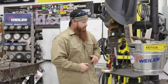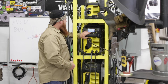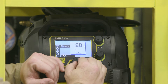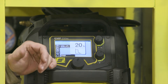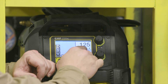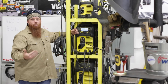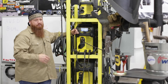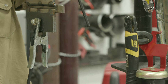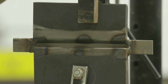Let's talk about equipment setup. We're going to be using the shielded metal arc welding process today, welding on the Rebel 235. Hot start is about 26% and arc force — or dig, as it's referred to on other machines — is about 20%. We're set up at 125 amps using an eighth-inch 7018 electrode. It's going to run very similar in horizontal as it does on flat, so not too many adjustments. We're running DC reverse polarity, with the workpiece clamp as close to the workpiece as possible, and run-on and run-off tabs about an inch to an inch and a quarter on each side.